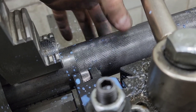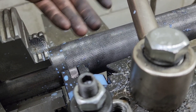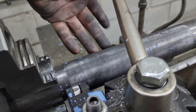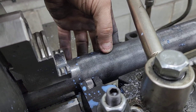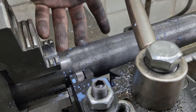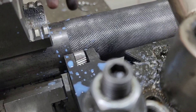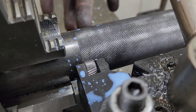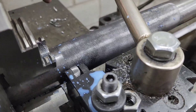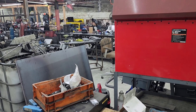I've got some concern over that — if I don't put something like a steadier up here to do it, then you're looking at needing to do the knurl in one pass. It's either one go or you're done, because you'd need something to stabilize it. It's a concept I'm going to play around with in the future. One wheel on both sides may be faster if you could knurl in one go, but it may not produce as good a knurl.